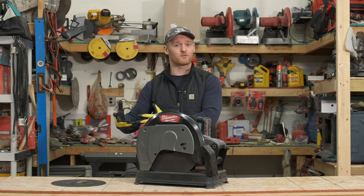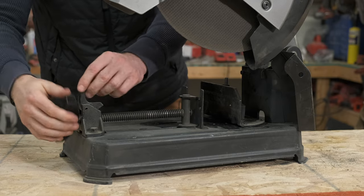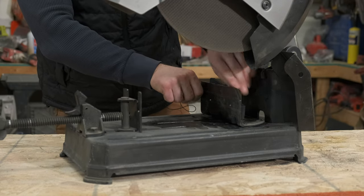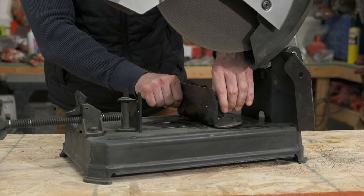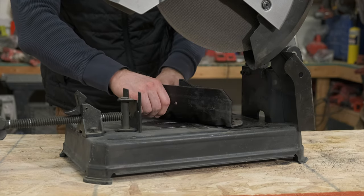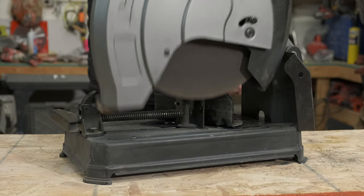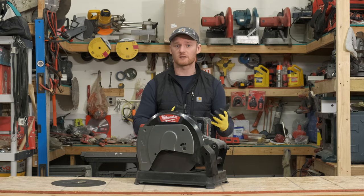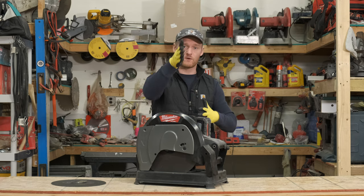The last part of this tool that makes it better than its predecessor is the slide and fence. If anybody remembers having to throw the slide, it would always be rusted, or the chain that held it down was always either rusted or just antiquated. They've changed that — now you just throw your thumb one way and you can pull back your slide. As for the fence, it's a quarter turn one way and you can bevel it from zero degrees all the way to a 60 degree angle. We can take it from an 8 inch stud to a 10 inch stud just with a quarter turn and back. We primarily use it for our gussets or for some of the joists we have to tie back into buildings.